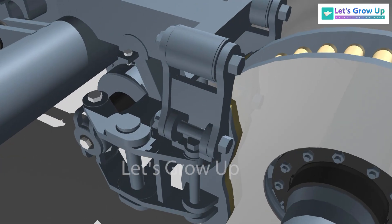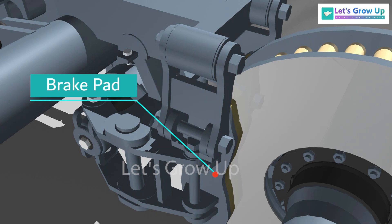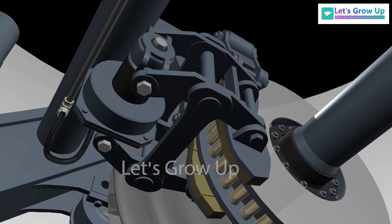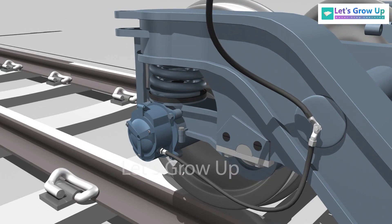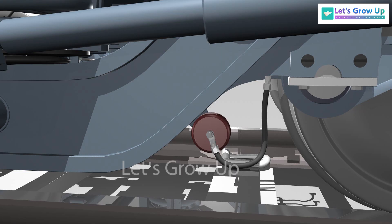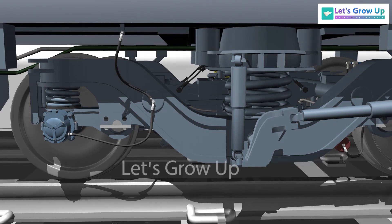It consists of a brake caliper, a 35-millimeter brake pad, and a brake disc with a diameter of 640 millimeters and a width of 120 millimeters, along with a 10-millimeter brake cylinder. Each bogie is fitted with an earthing device and three resistors to protect the bearing from return currents.